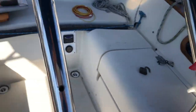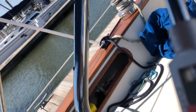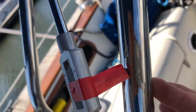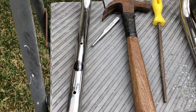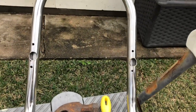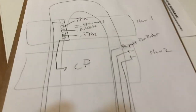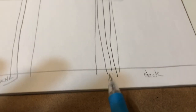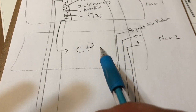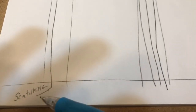I'm tapping the screw holes — this one's done. I put a little piece of tape to measure the depth to make sure I tap into the backside of this stainless steel pipe. Now we're making the holes for all the cables. Really hard to drill through this stainless steel — this took me about an hour and a half, maybe two hours. My handwriting is pretty atrocious, but this is the layout of the wiring for the NaviPod installation with the helm guard. This is the deck, this is the chart plotter, and this is the three-instrument cluster above that.